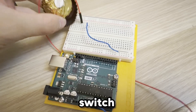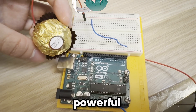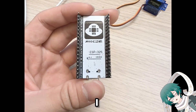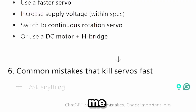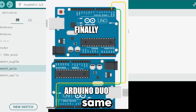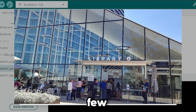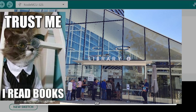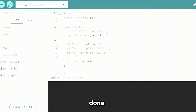I finally decided to switch from my precious Arduino to a cheap and powerful ESP32 so that I can still use my Arduino for future projects. Coding an ESP32 is almost the exact same thing as coding an Arduino — you just install a few different libraries onto the Arduino IDE and a few drivers as well, then change up the pin numbers and you're done.